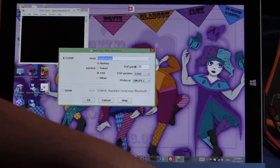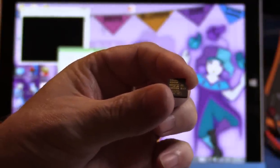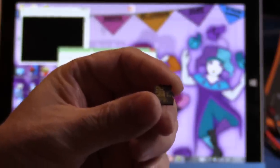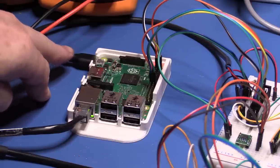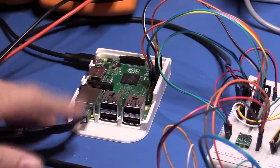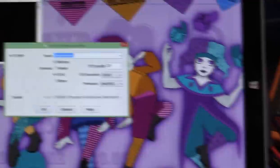I've already downloaded and installed onto an SD card a copy of the latest Raspbian from the site. I'm just going to plug this in and power up my Pi. Once it's up and running, we'll log in remotely with an SSH shell and go from there. The Pi is now powered up. I've got USB power from a hub just providing power to it, and I've got the network port connected. I'm not using the HDMI connectors or anything else — everything we're going to do is through the SSH connection on the network port. I'm using TeraTerm that I downloaded and installed on my tablet.